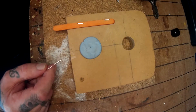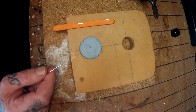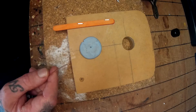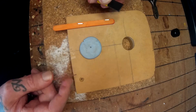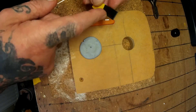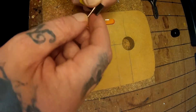Welcome back. What I'm doing now is an omnidirectional bi-quad antenna for 5.8 gigahertz FPV. I've made up a little template with the same measures from the last video, which is 12.81 millimeters.